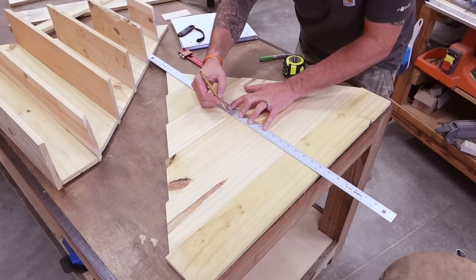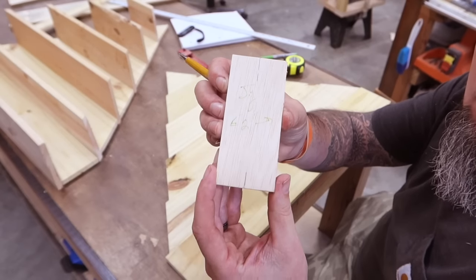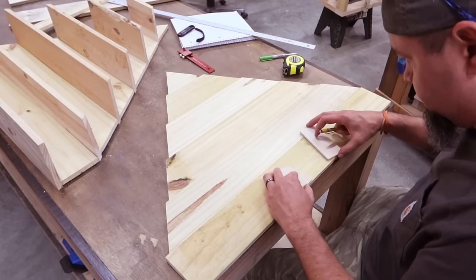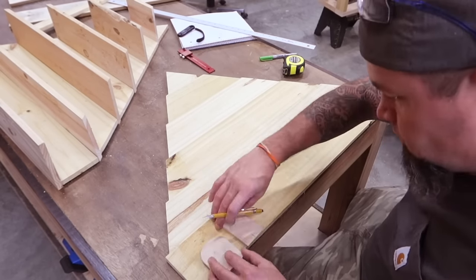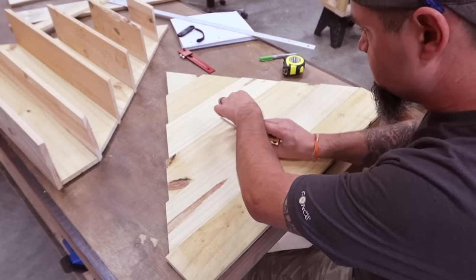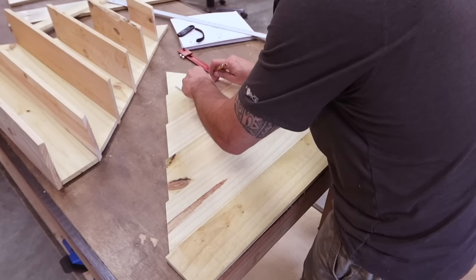I'm making a straight line on center because all of these parts are going to be based off center. I'm putting a center mark on my door template as well as this little two inch spacer I've made. I'll take the center mark of the two inch spacer and line it up with the center mark of my bottom board — mark both sides and that gives me the edges for my door spacing. This allows me to have all of my doors two inches apart. When we move up to the next level, alternate between your spacer and your door outline on the center mark, and continue until we reach the top.